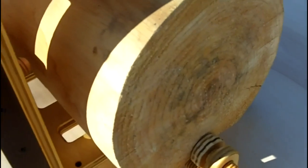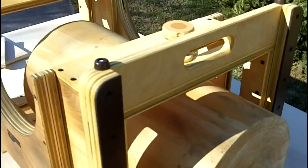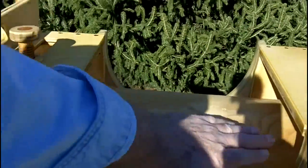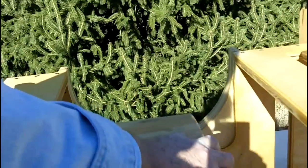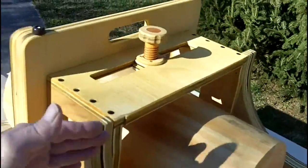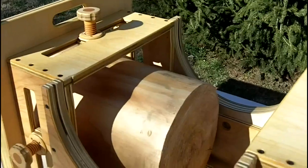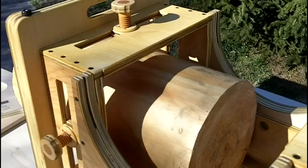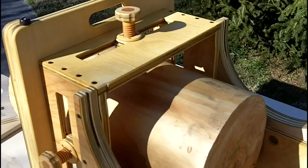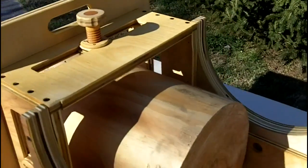The other idea that they presented, in fact, the reason for them to order a saddle notch jig, was really not for a saddle notch at all. It was for a quarter round for joists, and what they're actually going to be doing is their joist is only going to go in halfway, and they're going to notch just a quarter around so that two of those could splice over a carrier beam. And you begin to see it's quite a daunting task with a huge joist and a bigger piece of equipment. It's pretty easy to do with the chainsaw.